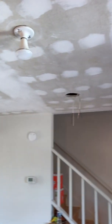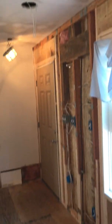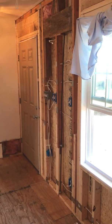And I laid out the lighting grid in this room where the front half is on one set and the back half is on another, and ran switches 3 ways so that they could be turned on and off at either side of the room.